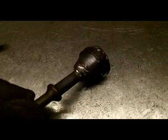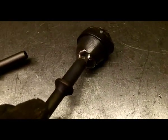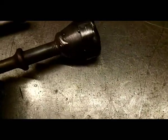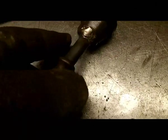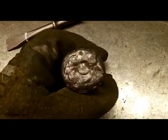I've then used a stick welder. Stick welders are very very useful machines, one of the cheapest welders out there, and if you can master them they're great things - one of the first welders I ever used when I started my time in the shipyards. I've actually used a couple of different rods here. The chrome type one at the top is actually a dissimilar rod, it's used for welding different types of steel together because the shaft's hard and that's mild steel. Then I've welded the face of that using a face hardening rod.